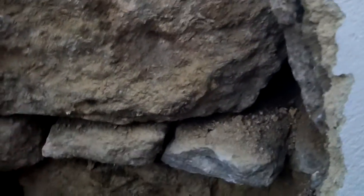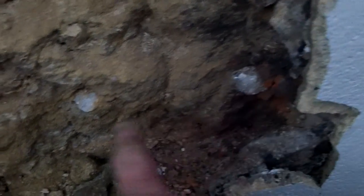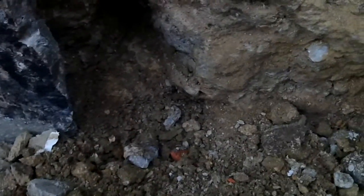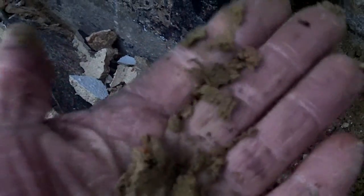There are little clenches here just to level the stones. Down the bottom we've even got a failed damp proof — there's a huge great hole drilled here and another one there, and this is the gunk that they squirted into the holes at some point. That was supposed to damp proof it apparently, but it didn't work very well, because all above it the mortar is sopping wet — absolutely horrible, it's just mud.